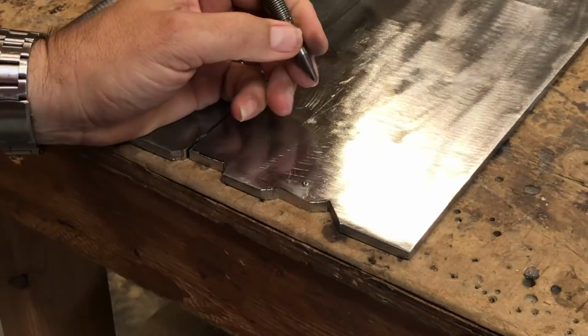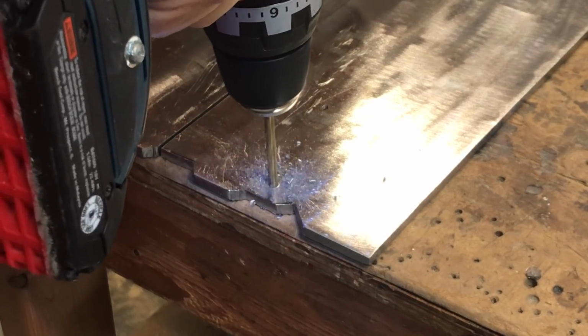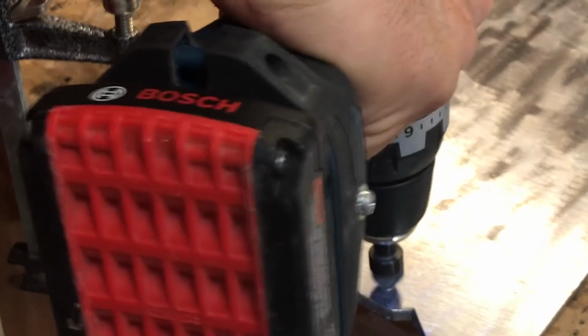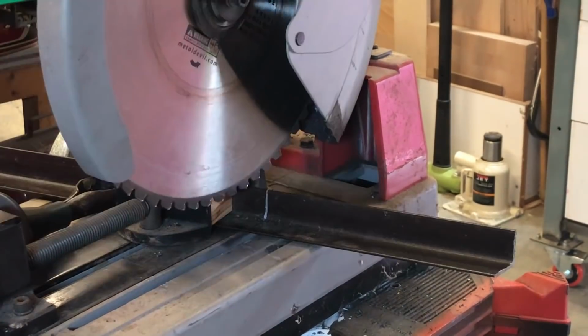Next, you have to drill and tap a little hole to help keep the blade at 90 degrees to the table. I just tapped it for number 7 drill. Tapped for a quarter-inch 20 thread, which takes quite a while in quarter-inch plate. Slow and steady. Didn't want to break a tap. Quick chamfer on it from top and bottom. Clean up any burrs. And this is just a quick stove bolt I found just to see how it worked and see about leveling out.